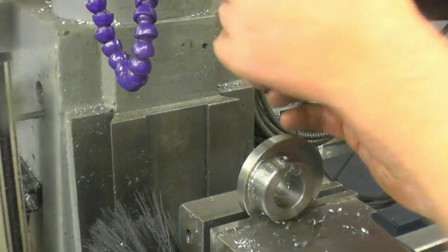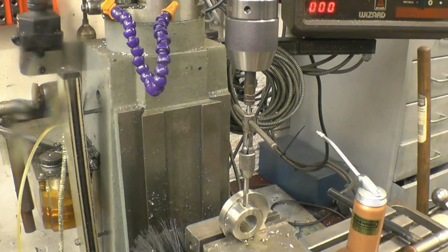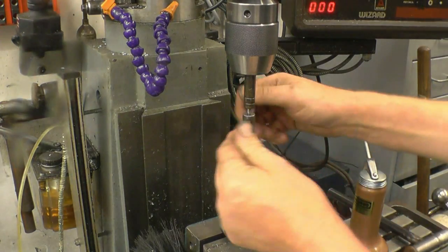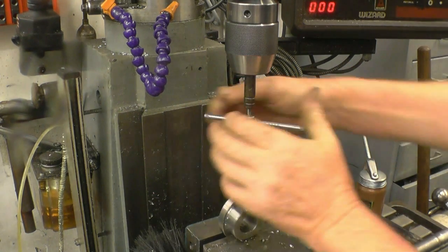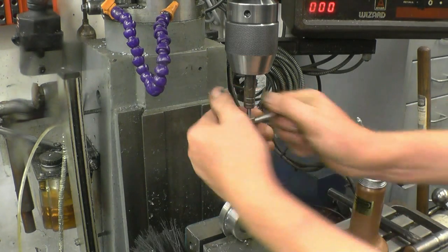Right, discretion being the better part of valour. It has got a centre in there. I'm just going to tap it by hand. I just don't want to snap a tap off on there after all that work. In hindsight, I could have just done this 6mm and nobody would have known except me, but we'll try and keep it authentic. This is the spring-loaded tap follower I got from the Brazee Summer Bash. It's the first time I've actually tried to use it. And by the feel of that tap, I'm pleased I decided not to do this under power. I'm just making hard work of this.